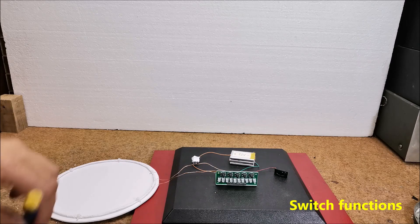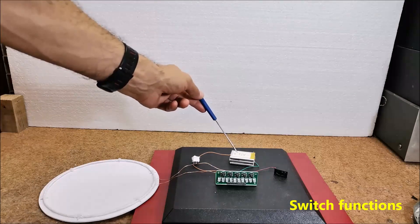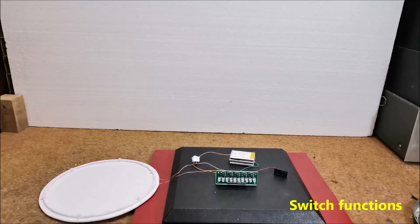We need to rotate the tuning resistor until the device begins to make sounds on its own, and then turn the potentiometer a little so that the device is silent. I'll skip this step for now because I've fine-tuned the device before. At each position of the tuning resistor we need to press switch 4 — the reset button — and check sensitivity again. A good result by air can be considered 20 to 25 centimeters for a small coin.